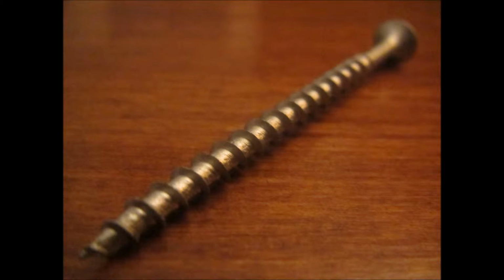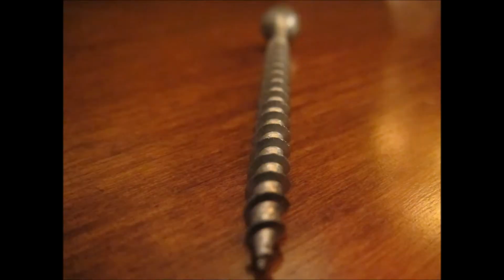There are three main areas in which galvanized screws are used: coastal environments, treated lumber, or the outdoors. Galvanized screws are particularly popular in a typical coastal environment because between the heat, humidity, and devastating effects of wind-borne salt, coastal environments have long played havoc with construction, and galvanized screws are recommended for use in almost any project near the ocean. Salt in particular quickly wears away plain steel screws, turning them rusty in a short period of time and necessitating repairs more often.